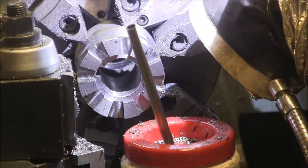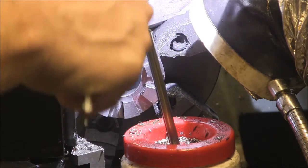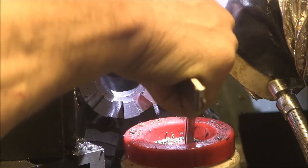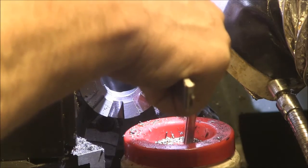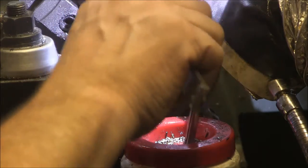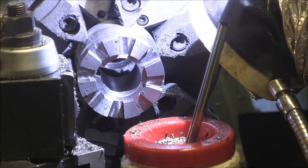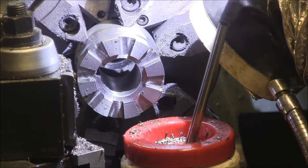So now I've got an index over here. I'll zero my little indicator that's on the way, and I want this groove to be five-sixteenths in width. I wish I had a left-handed caliper. So we are at 240, 242, and I want to go to... we are going to move over 70 thousandths.